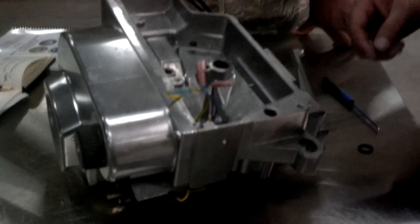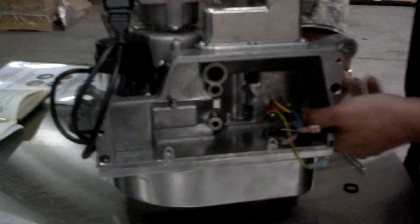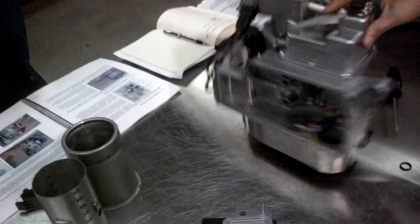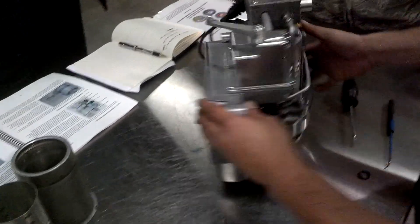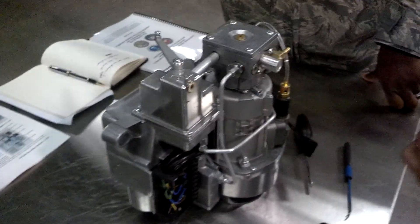One of the reasons why I took the front flange and all that out first is because I knew I was going to turn it upside down, and that kind of balances the burner for me. If I had the flame tube and air tube here, it would tip over on me, so now I can work with it pretty easy. That also gives me a top view of the next thing I'm going to be working with, which is the sump and fuel pump replacement.